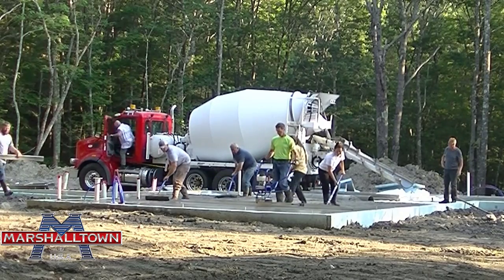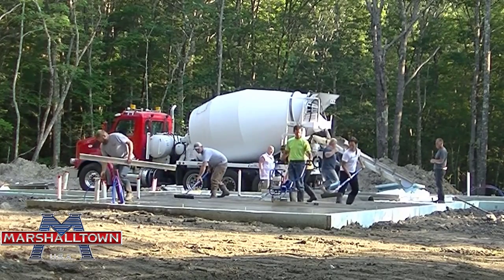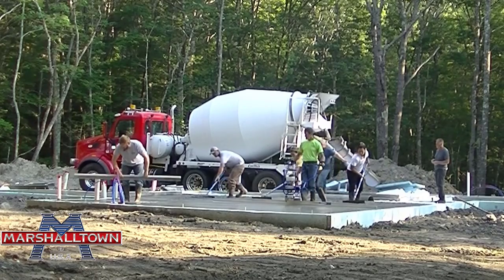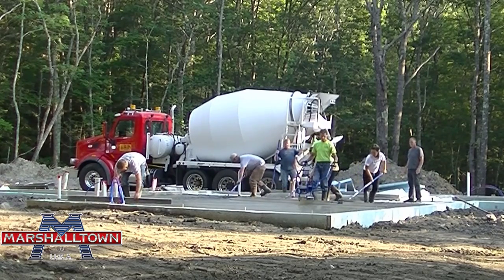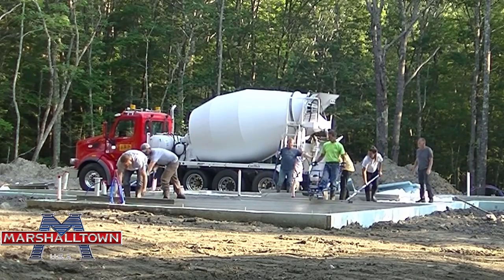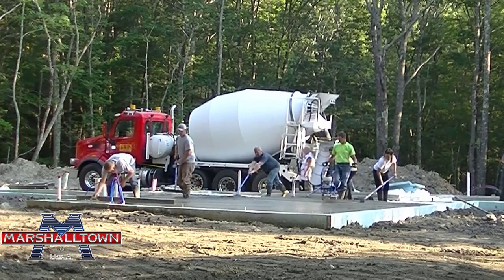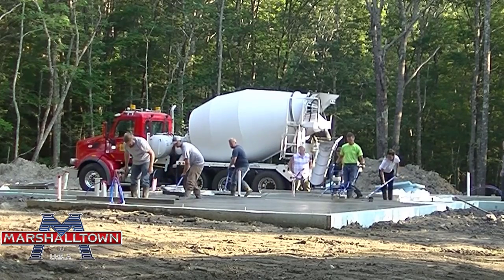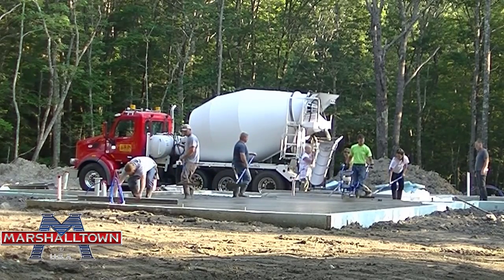If you watch my head, I'm going back and forth from one side to the other, watching the ends of the screed making sure they're both touching and not riding high or digging in. The key are the two rakers — I've got Tia and Abby raking behind me. Their job is to keep the concrete just a tiny bit higher than the level of the floor so the vibra screed is pulling that concrete back. They don't want to get it low and they don't want to get it too high. The rakers are key to making these floors level. And then you'll watch Darren over there with that eight-foot hand screed — he's bending over and pulling back and then stepping back. It's just ten times easier using that vibra screed.